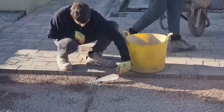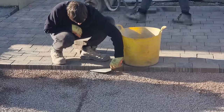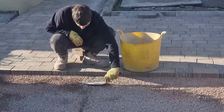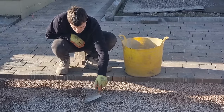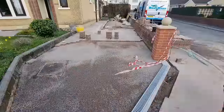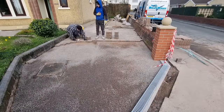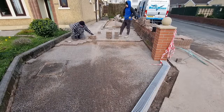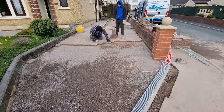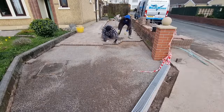Just fill in where your rails have been, put the 6mm chip in, and compact it down with the top of your trowel, like Fraser's showing you there. Then you can get on and lay your paving — me and Fraser take turns. This is a Marshall's Tegula paving system that we're installing here, three different sizes. Really, really nice.